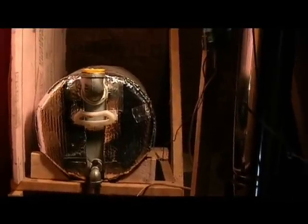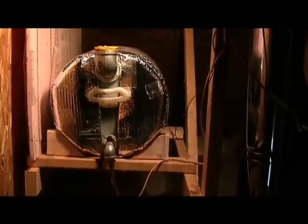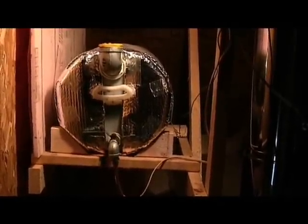Take you up to the bulk tank up here. It's all very simple — everything is very uncomplicated, which is what I like. This is my bulk tank; it's one of the plastic 15-gallon drums. The top has got an inch and a half street L in it — that's how I pour the fuel in. Down below it's got a nipple with a ball valve on it, and that runs down to a mason jar which is just a water separator. From there it runs down to my burner. When I run this thing, I'm burning about a gallon and a half to two gallons over an eight to ten hour period, depending on how hot I'm running it.